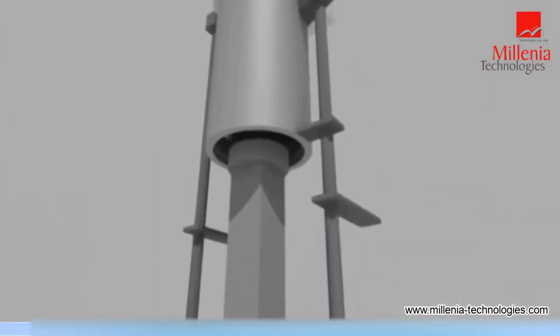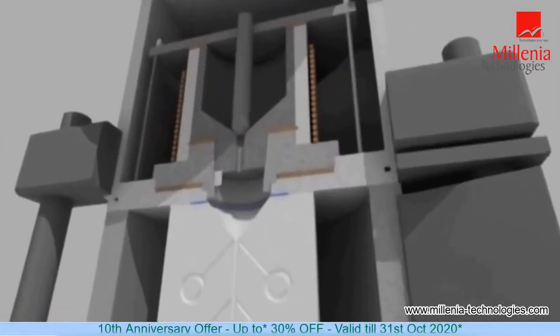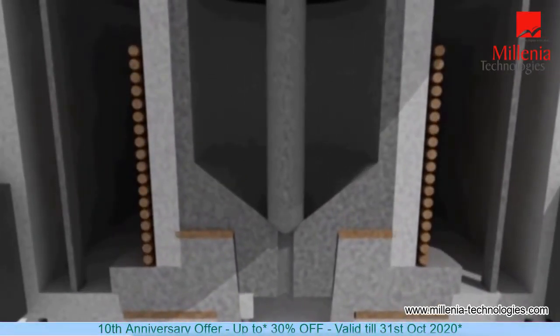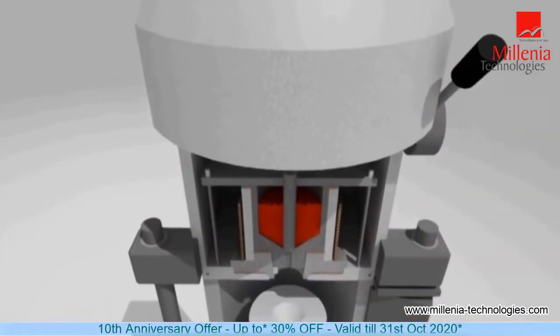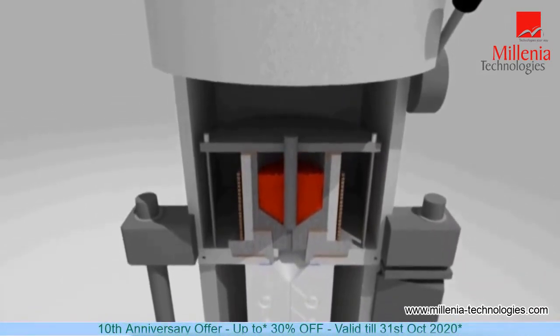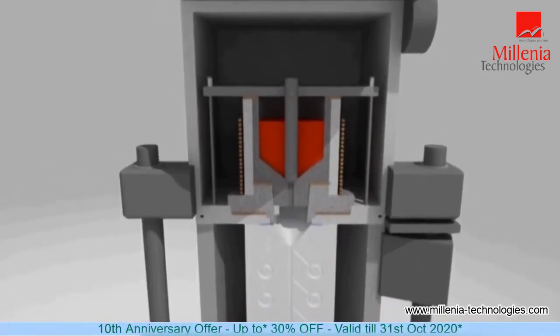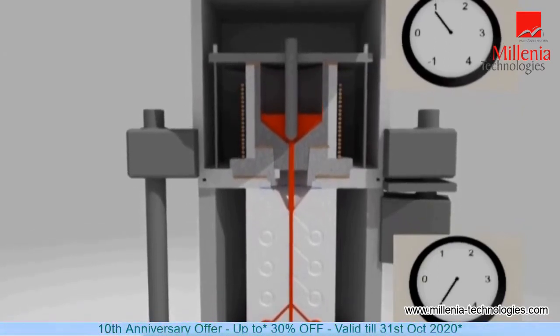In the separate chamber machines, the syringe effect is guaranteed by special gaskets and cements underneath the crucible to keep it sealed. After the vacuum is applied, the flask is pushed against a silicone gasket, and inert gas is supplied. When metal is molten, it's poured into the flask, and at the same time a gas pressure is applied to the crucible chamber at one bar maximum.